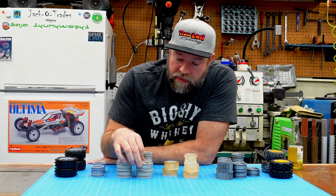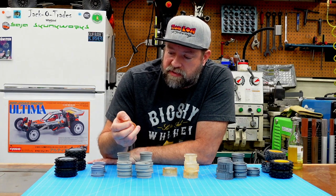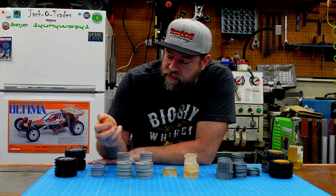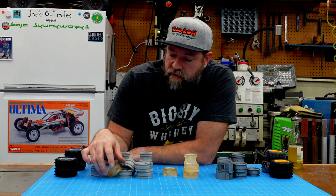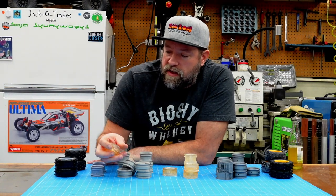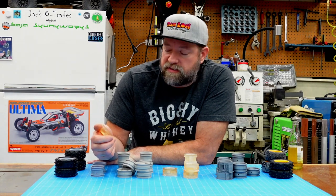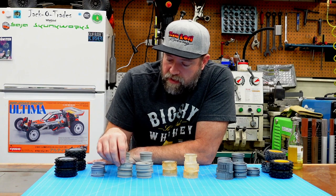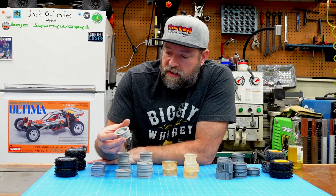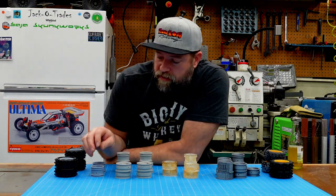This is conventional material. The thing with conventional SLA prints is that it's very brittle - it's like glass almost, more brittle than acrylic. What I'd like to do is some stress testing where I put this under a press, get a load cell on it, and figure out how much force I can put on it before it fractures, and how much deflection there is before it fractures as well. I had some other gray material that I went ahead and printed on - this is standard conventional material as well.